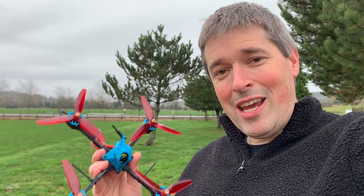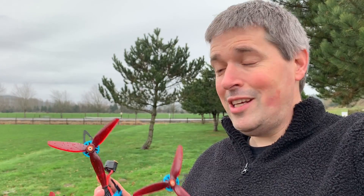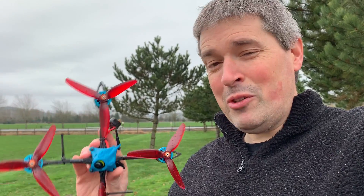For myself, I feel like this build is kind of in a weird place. For it to really have the authority and power that 5-inch deserves, it needs to have a stiffer frame and bigger batteries — and then it's just going to be like any other 5-inch. That can be great, but it's a well-explored space, so I don't think there'd be anything really special about it in that case. So I'm kind of interested in going the other way: even smaller motors, even lighter props. If I put those 1505s on a frame this size with the two-blade HQ props, it'd be about 35 grams less all-up weight and it'd be able to fly longer with a smaller battery. On the 850mAh 4S battery I did get about 3 minutes and 50 seconds — that's not bad — but an even lighter build would do even better. And when I did push it I was getting 50 amps of load, and there's no way the battery can hold that up for very long.